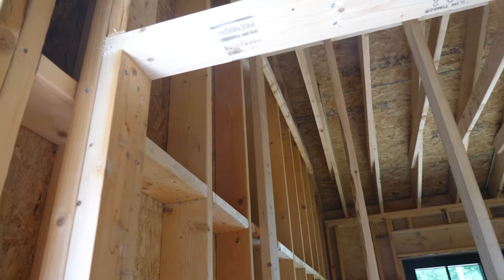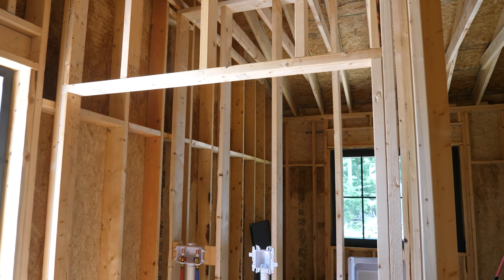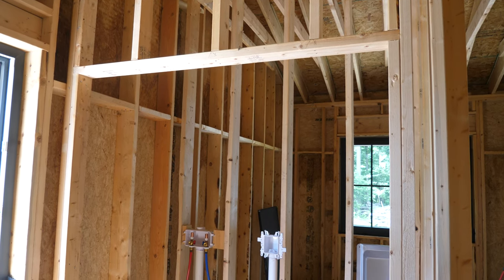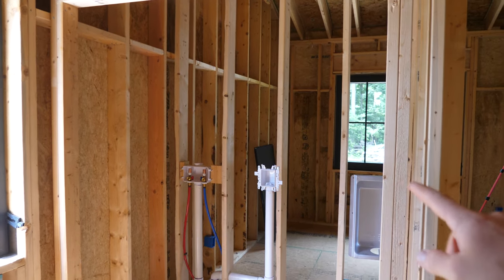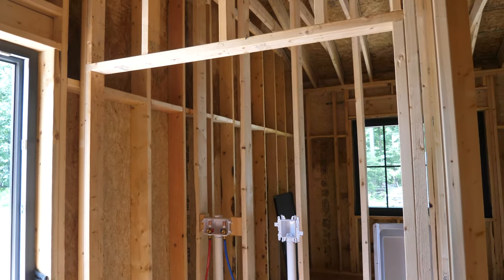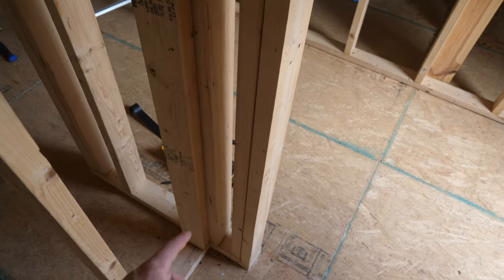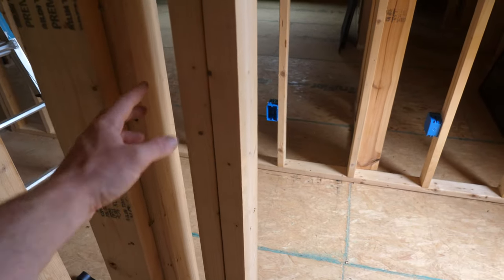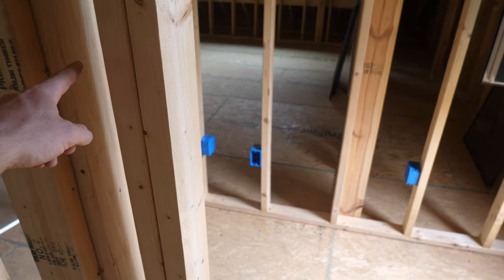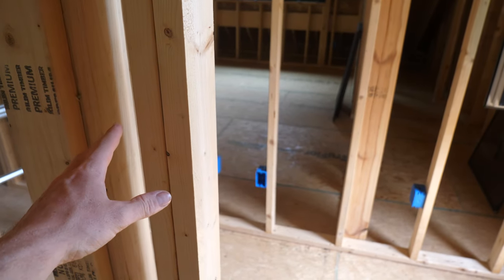I'm going to add one more two-by-four to this opening. The more difficult part is on the right side — we only made this opening 54 inches wide. That's the width of a washer and a dryer pretty much exactly; they're about 27 inches each. After the fact we realized that the doors for the machines might end up hitting the jambs if we go to open them to the outside. So more than 54 inches is really more desirable. I'm going to remove these two studs and add one stud over here to open up the opening probably four or five inches total once we have the jambs on.